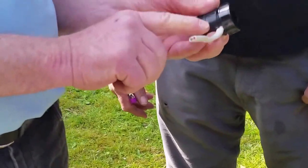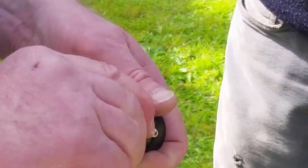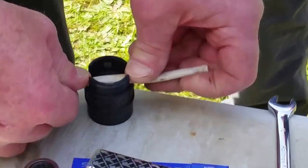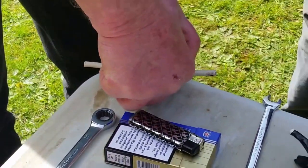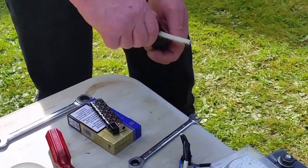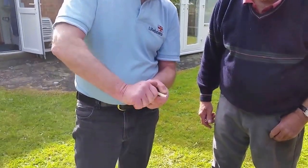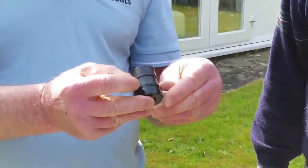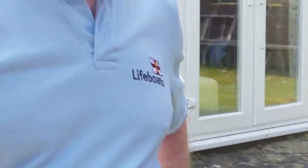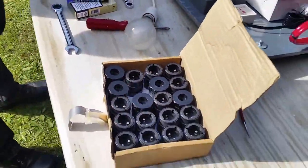You need a box of cable clips and a cable, but buy that there. Don't take the cable and the cable clips with you. Just lay that in there and it squeezes, like we used to use on site for 110, festoon lighting it's called. Right, and that's it, screw it down firmly. And you'll find now that if I connected that up, you'd have a light in there. And you've got enough there, look, to wire up the whole nunnery, providing you use the low wattage lamp.